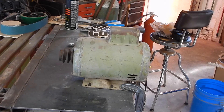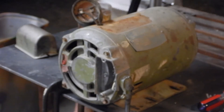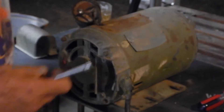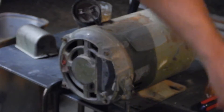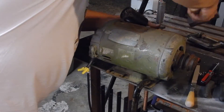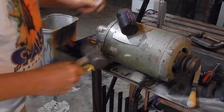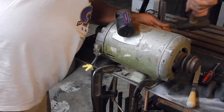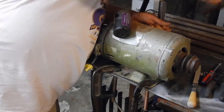That is really nice. I'm very happy with that, and the only problem is it's turning the wrong direction. But I should be able to fix that. After examining the wiring as best I could from the outside, I decided to open it up to see if there's a clue about reversing the rotation on the inside. The data plate says 60 hertz instead of 60 cycles per second, so it's newer than 1960, because that's when they made that change. It was really difficult to get the end caps off, and in a minute you'll see just what a bear it was to get the pulley off.